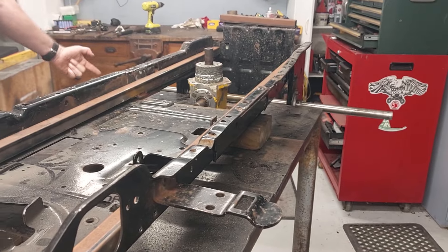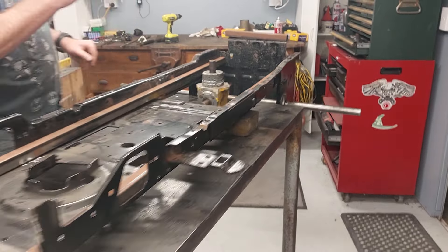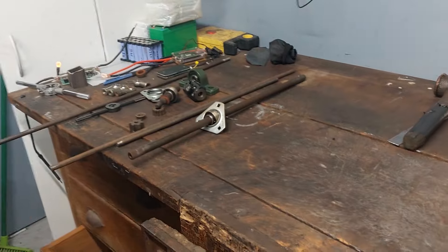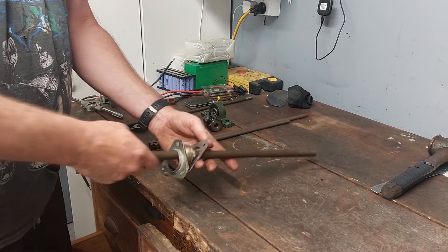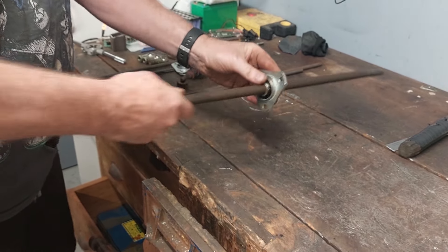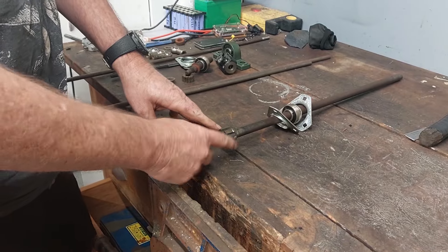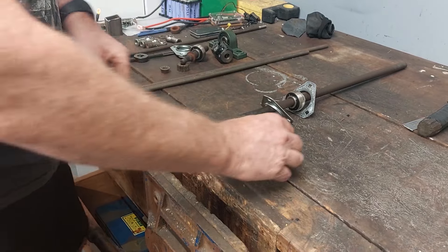Progress is good — the basic stuff is right. I know I've got the length of the chassis right and we'll weld those bits up. Come over to the bench and I'll show you another couple of bits I've been working on. For the steering, I was going to use much bigger bar but it was a drama getting bearings of the right size, so I'm actually going to use the steering bar that was already in it. I've got a couple of bearings from Peter at Motive — these go at the top. I've also taken this splined part out of the old plastic steering wheel, and I'm going to weld it onto the plate so I can pull the steering wheel on and off and move it if needed.